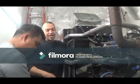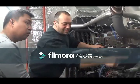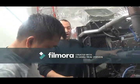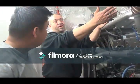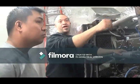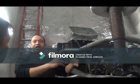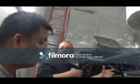So that voltage is coming out from here, or? No, this one is actually feeding the batteries. Right? So, that's the one charging the battery. Exactly. So what happens is the controller of the generator is always taking power from the battery. That's how it monitors, checks, and communicates. It's all communication. It communicates with the transfer switch to let it know.